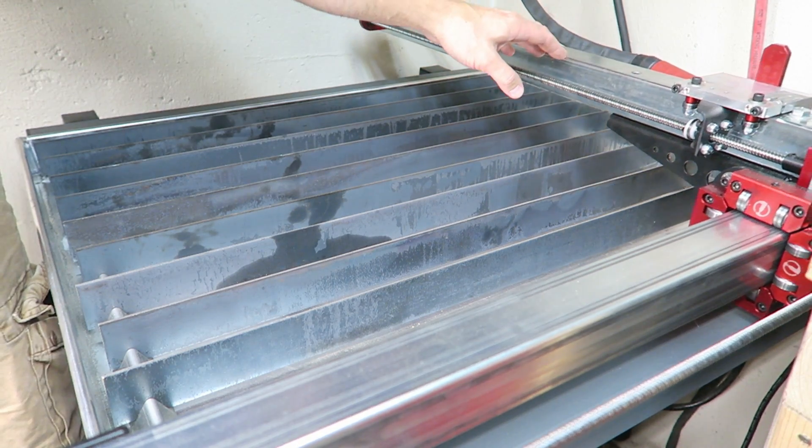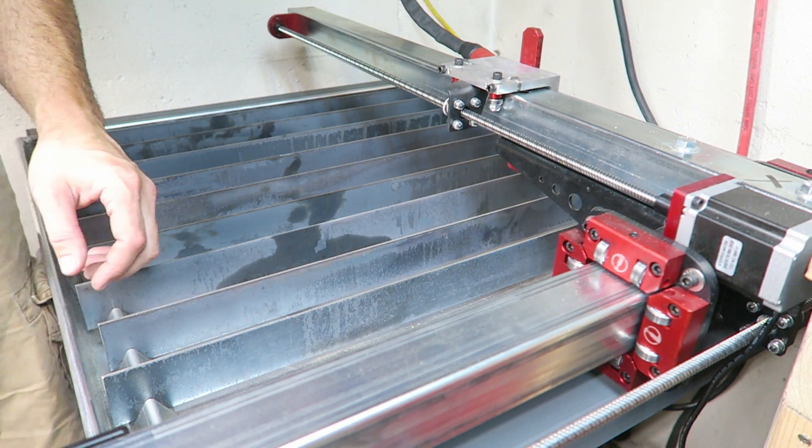On the negatives: I would not classify this machine as being really robust. It is an entry hobby-level machine. If you're looking to get this technology in your shop and play around with it, absolutely — this is the way to go. But if you have a lot of orders and you're looking to crank them out day in, day out, I would not feel comfortable building a business around the Crossfire. It feels a little fragile. There's a lot of friction between the drive nuts and drive screws, and it is absolutely imperative that the drive screws are well lubricated. I use white lithium grease and apply it before I run it every time. You've got to keep the drive screws completely clean of metal dust and debris and then lubricate them every time.